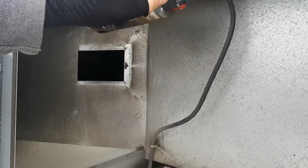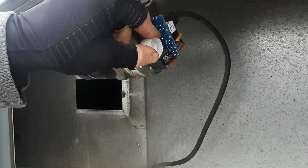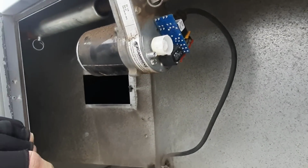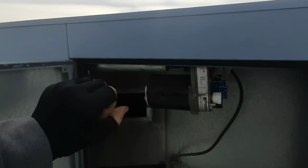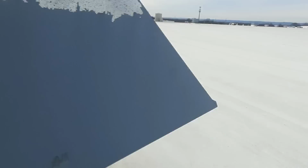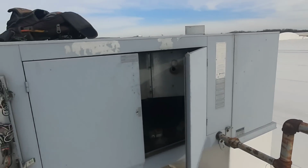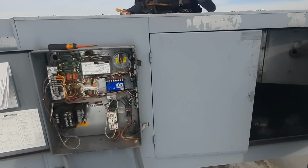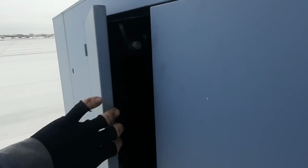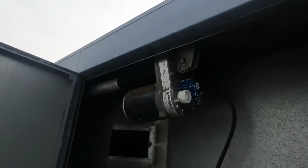It's just the whole opening thing that was, I'm gonna go a few clicks back and see where that gets me, because you could see it pushing, like the damper stopped it, and you don't want to lock it up either way, because these motors are a pain to change. They've got a new kit for them, and it's using a different type of actuator, but we don't want to play that game either. So we should be able to just put it in local now and just make sure we're fully open.